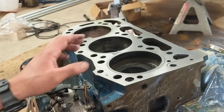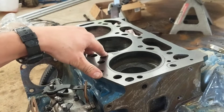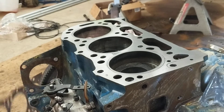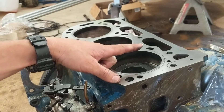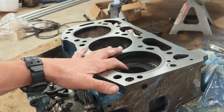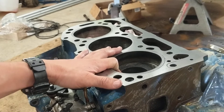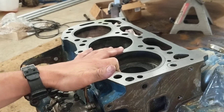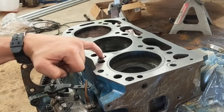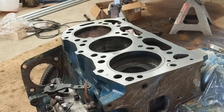This is ready for the head. I'm gonna take some cleaner and clean off the WD-40, make sure I blow out all the holes. In my other video I measured the piston extending out the deck — head gasket thickness is going to be around 20-30 thou quench with a 54 thou head gasket. More compression for a diesel, more heat for a diesel — that's good as long as you don't over-heat it. Anyways, that's where I'm at. I'll give you some updates as I go — probably more videos to come. See ya.